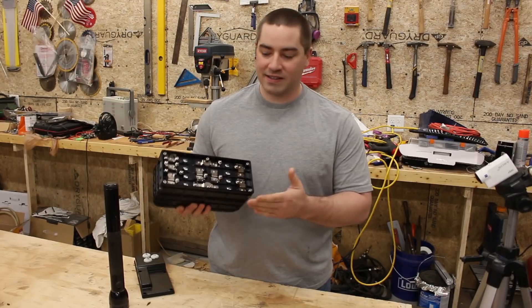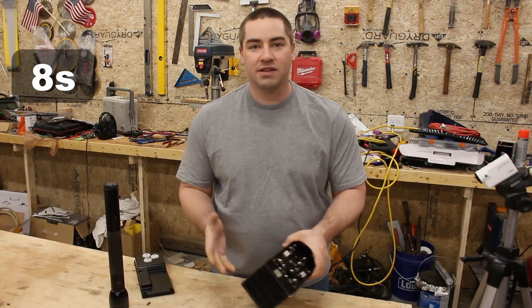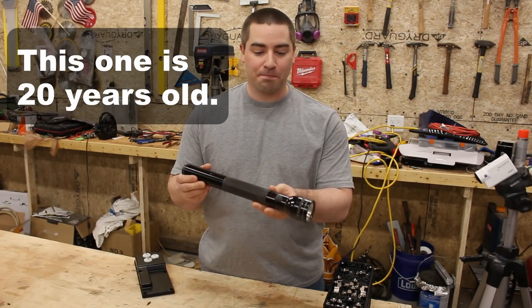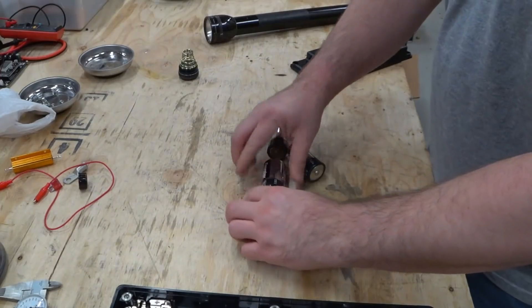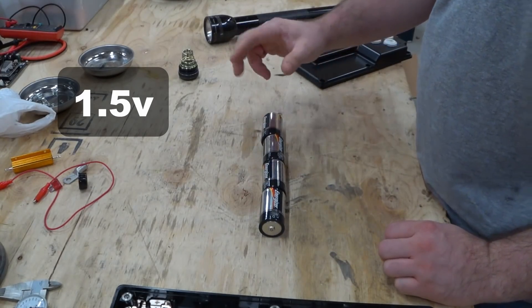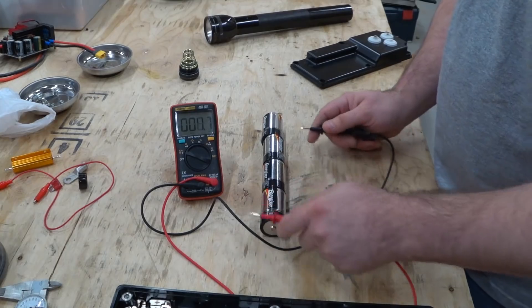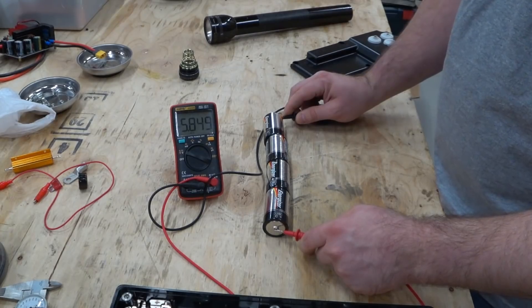This is an LTO battery that I discussed in my last video and there are 8 cells all in series. Series cells means that we're setting them up positive to negative, positive to negative. Anybody remember these? This is an old Maglite. They're not as popular as they used to be. This one still has a little bit of charge. So right here we have 4 cells in series. Alkaline batteries are typically 1.5V each. So if we look at just one cell, we have 1.462V. And then if we look at the whole string of cells together, 5.84V.